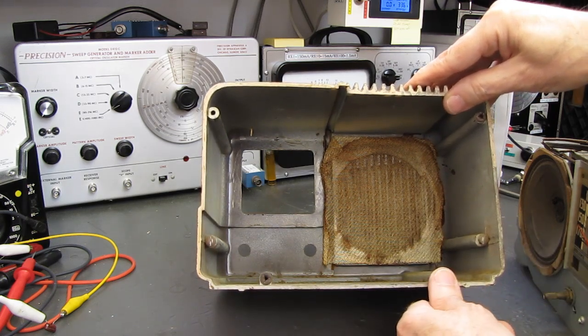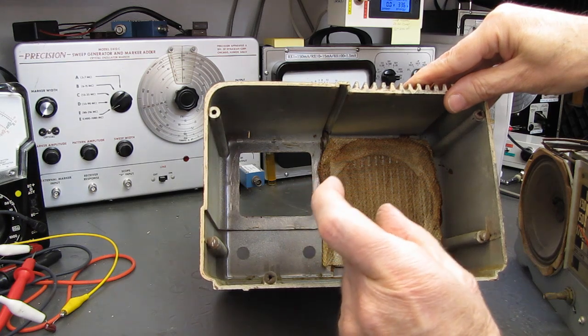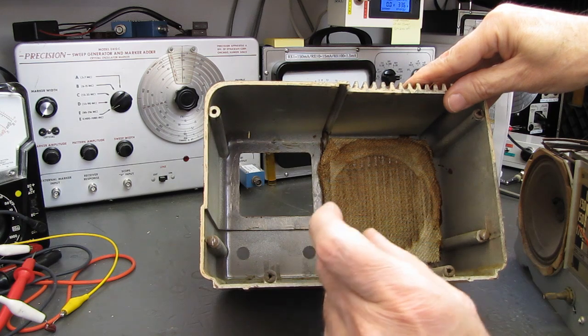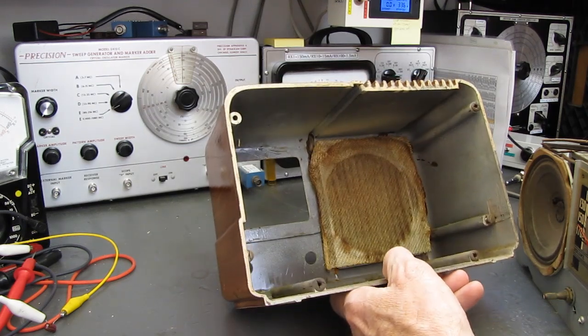And when that was set up, I drilled it and tapped it, and I did the same on the one that was still existing. I tapped them about 1.5 inches deep as I could get the tap in. And then I used a long threaded screw so that it had plenty of thread to hold it in. Came out pretty good. I was real happy with the results.